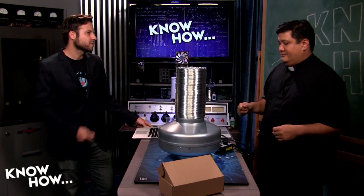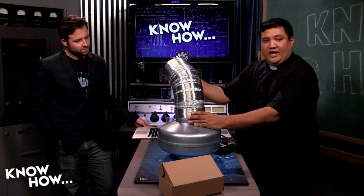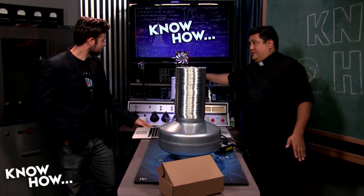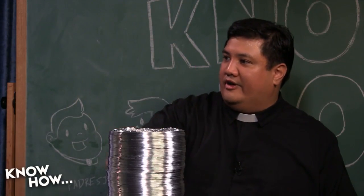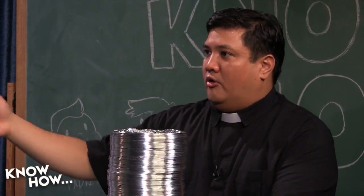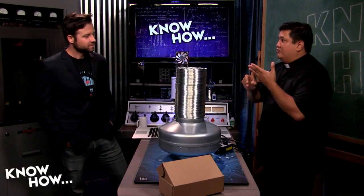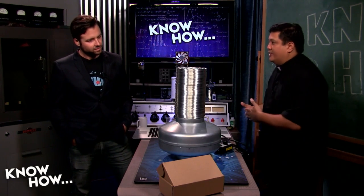We would do that with the quadcopters and the cameras on them. Precisely, exact same thing. So what I would do is take my fan and put the suction side onto the carbon filter. So it's sucking out of the tent, going into the inline fan, and then I would take this, the outlet, and run it out of the grow room, because ideally I want the hot, humid, carbon dioxide weak air out of the grow room so that I get fresh air pulled in.